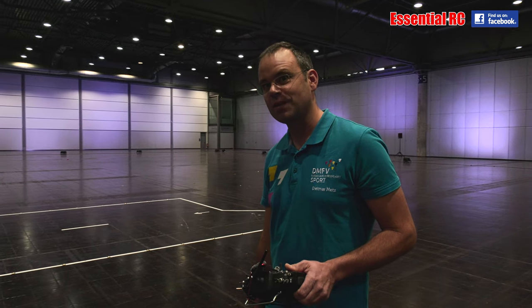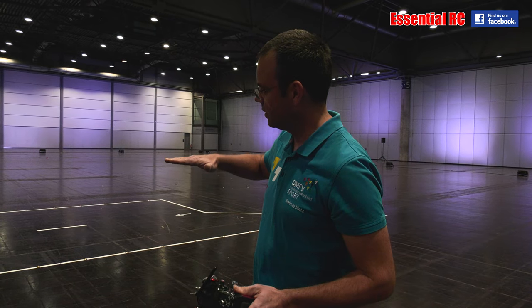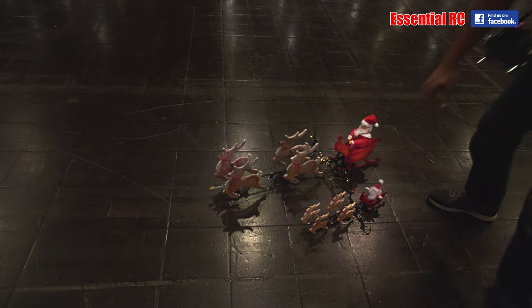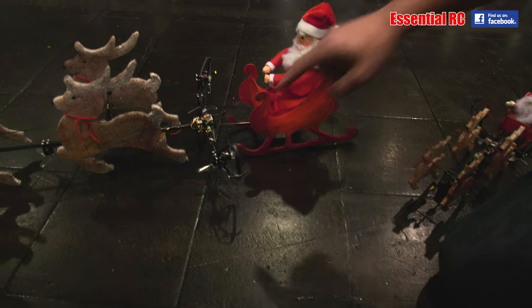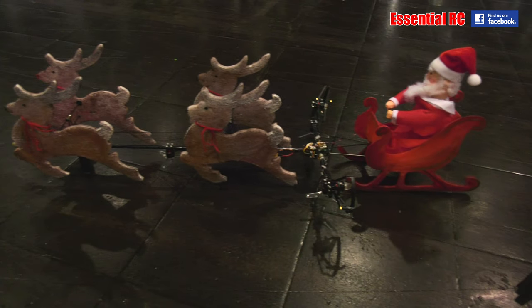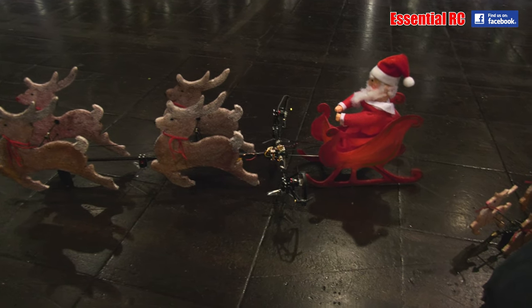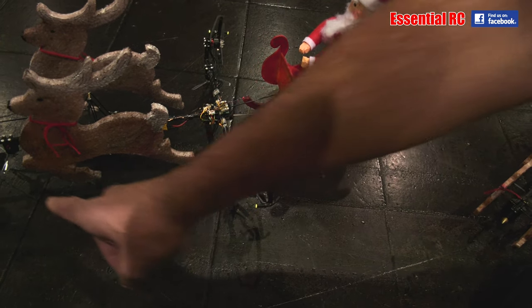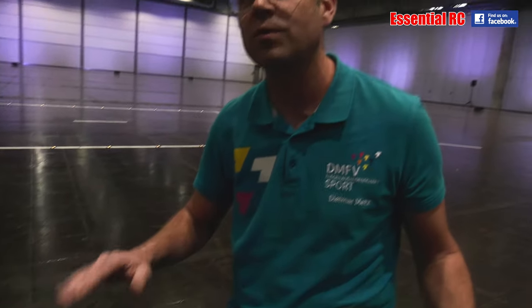Same concept, but used on a different theme — because to fly upwards, if the sleigh would fly forward like that it would not be really nice. So I needed five motors to have the full flexibility. I have two for the thrust and a tricopter which does the leveling. It's a pentacopter. And then you've got two pushing it forward. There's one more in the middle. I have five axes of freedom so I can stand in the air and rotate the axes without flying.